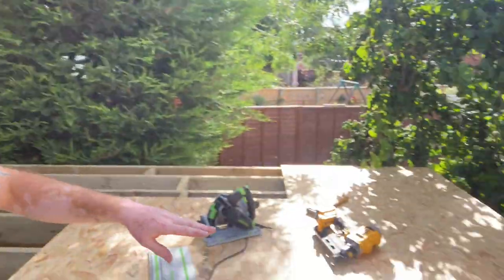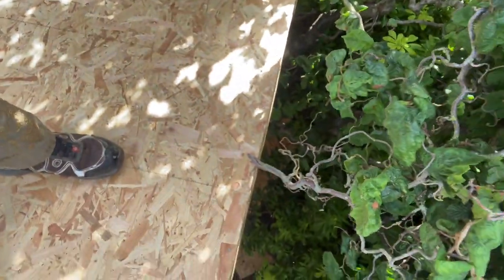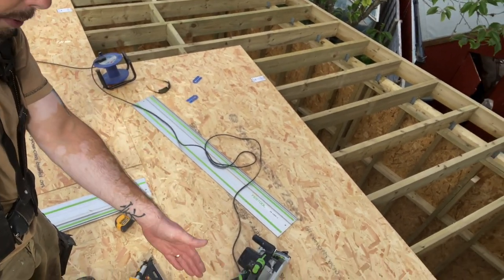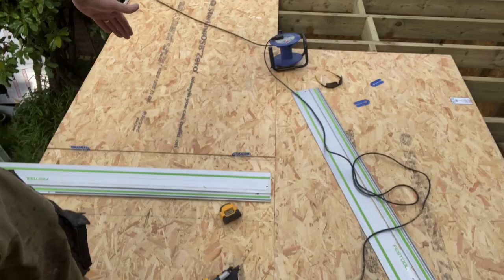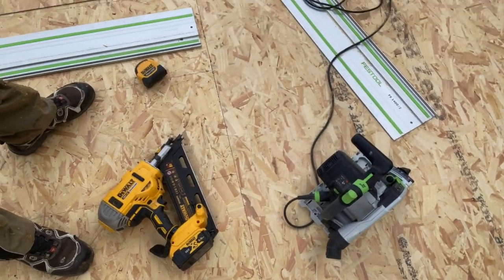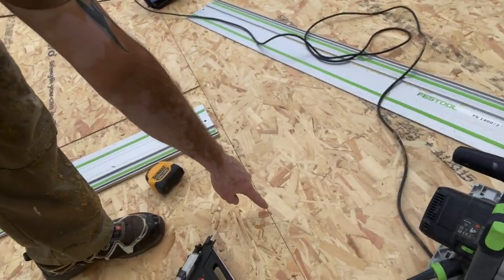Up on the roof - three boards are now up here. This is the first one, now in place. I've lined up the front with that edge, laid this one next to it, butted it up, and got this one overlapping the two boards right through the center, give or take. I fixed this one, then pulled the next tight against it. I dropped in 3mm spacers - I actually Googled it because I'd always been putting 4mm spaces in, and it turns out it's supposed to be two to three mil, so 3mm it is. You can see the expansion gap now.